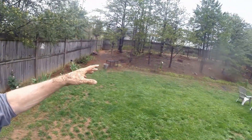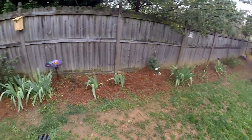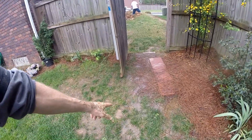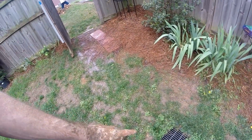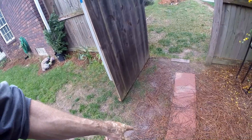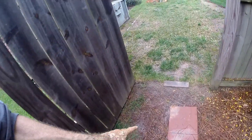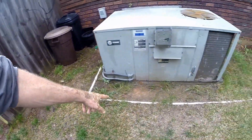You can see this hill in the backyard — all that water comes down and just stands in the yard. Someone added a couple of catch basins, but unfortunately they didn't put any gravel or perforated pipe through here. That's why the water stays — if there was gravel and perforated pipe under the ground, the water would have a place to go. Right now it has nowhere to go. They also ran their air conditioner condensation line over to the second catch basin.